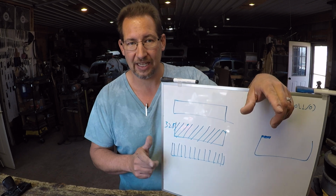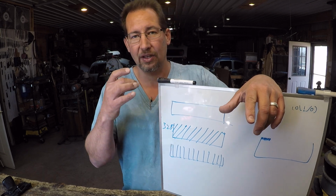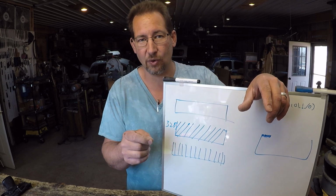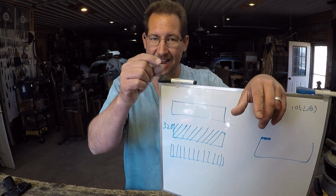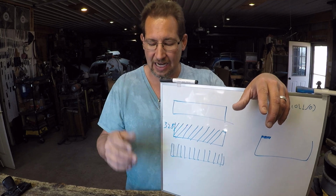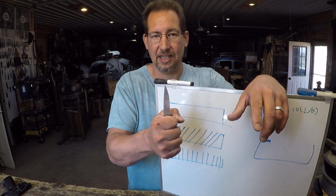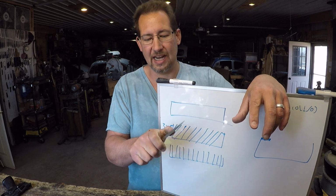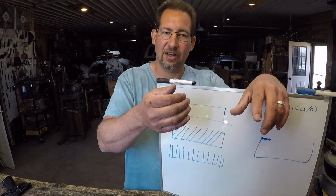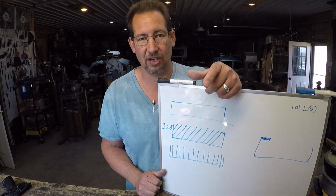So if you're having problems with edge retention, let's take that back a step farther. The lower teeth per inch, or the lower grit edges, cut with a lot less force because each one of those teeth is actually working. When you have too high a grit edge or a polished edge, now all of a sudden those teeth aren't really grabbing. So what you do is you start putting way more force behind the cut. The second you start putting more force behind that cut, you start putting way more pressure on that edge, and you start creating an awful lot more heat and an awful lot more impact type force into that edge, and it'll make it fail an awful lot quicker.